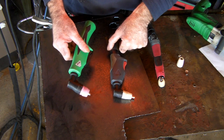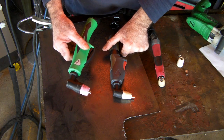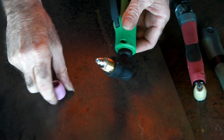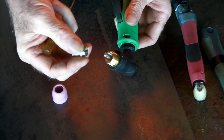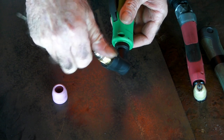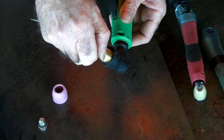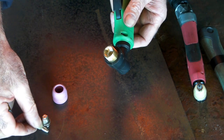These two torches have different things that go wrong with them - they're really basic to fix as long as you know what's going on. The AG60 torch is not too bad. You've got your ceramic cup on it, and with these cutting tips they're screwing in, which is a really good idea because they can't vibrate. You just screw them up finger tight and they stay put. The electrode also just does up finger tight - doesn't need to be any more than that, just tightish.